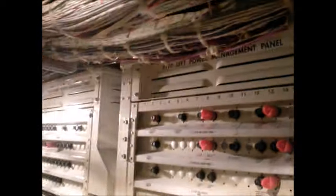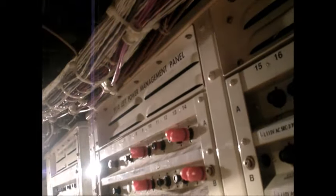These are different wire runs. Some of them are for electrical distribution, others are for data. For data, there are some fiber optic ones in there. They're separated depending on what they do — the heavy power cables are separated by themselves. You can't run those with communications cables because the electromagnetic field that emanates around them is so powerful that it would disrupt the communications.